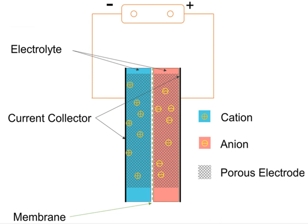The effective realized amount of energy W_EF is reduced by the used voltage difference between V_max and V_min and can be represented as W_EF = ½ · C · (V_max² − V_min²). This formula also represents the energy of asymmetric voltage components such as lithium-ion capacitors.